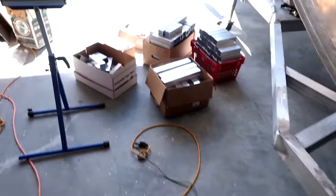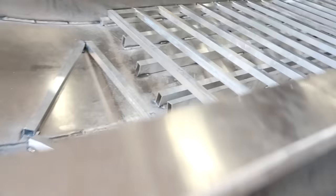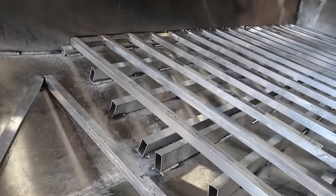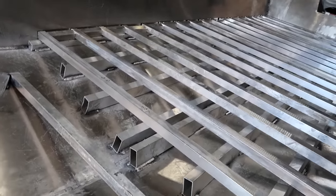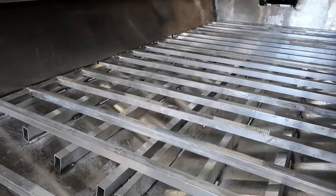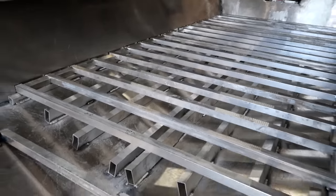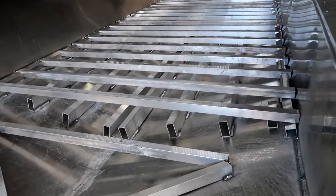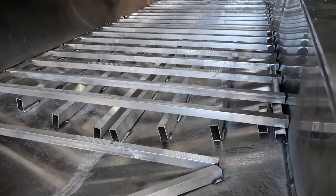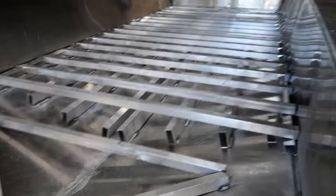A lot of cutting and a lot of welding left to do. There are 205 pieces and if I'm going to weld down two sides of each, that's four inches per piece — you do the math. That's 69 feet of weld, 820 inches, that I've got to make into the bottom of this boat. But what's going to happen is this floor is going to be super, super stable. It's not going to move around. I'm never going to have any issues with it flexing or popping, and this is only going to strengthen this boat even more.